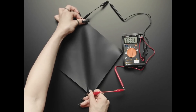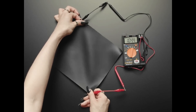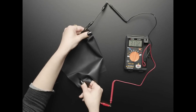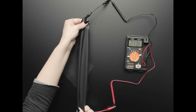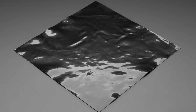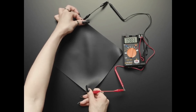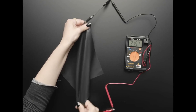Next up — we've long stocked conductive rubber cord used as a stretch sensor, and some people asked if we could get it in sheet form. This is carbon black-impregnated rubber. We have it in two thicknesses: one millimeter, and a half-millimeter version which is much stretchier. It's 200mm by 200mm. Because it's volumetric resistance — not a cord — it's roughly 50 to 70 ohms per millimeter. There are online calculators to figure out what that means, but basically the resistance isn't that high and goes up when you stretch it.